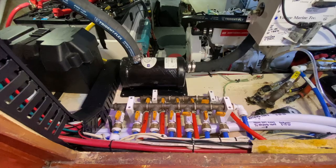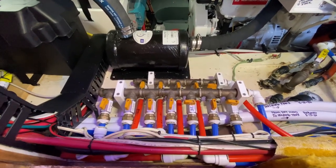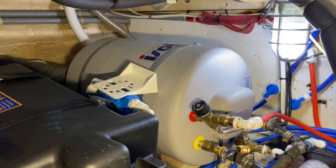The boat has also had a complete plumbing refit. We used PEX tubing throughout the entire boat, and all the plumbing — including sewer lines and sewer hoses — has been redone. Our boat has the ability to put sewage waste into a 45-gallon holding tank located under the galley floor. We also have the ability to pump overboard from that tank when offshore, and the heads can be diverted directly offshore by simply turning a valve.